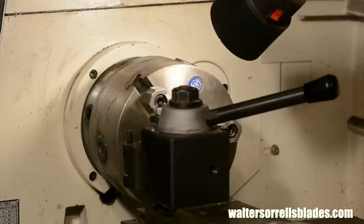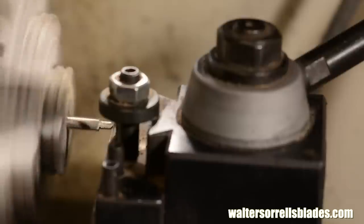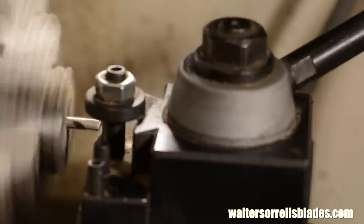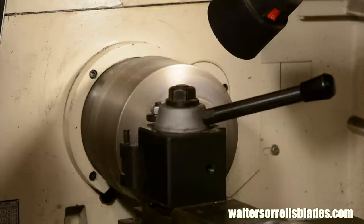Take it slowly and you're golden. Method 9. Take your drill bit to your nice big tool room lathe, chuck it up, load up a carbide cutter into your quick change tool post, and lathe this baby into submission. Concentricity and parallelism? Solved. Correct measure right down to the thousandth? A snap. Clean 90 degree shelf? Perfect. Two things. First, you need the right grade of carbide.